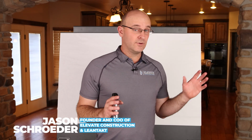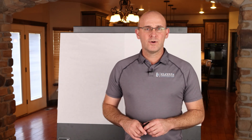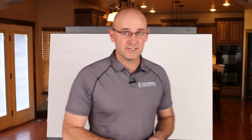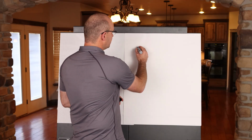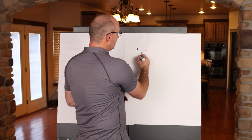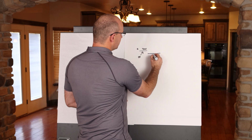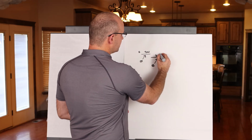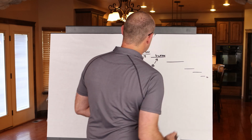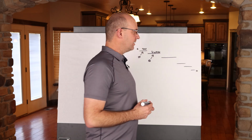So I'm going to take you through my process for estimating time for a project. One time I had a project executive sit me down when I was younger in my career and say, "Hey Jason, this is how you do it. You take your milestone and then you basically just draw a line, and if that's your mobilization, you estimate that. Let's say that takes 3 weeks. Then here's your basement over here. That's probably going to take about 6 weeks." And he just kept drawing this throughout, like an executive summary on a schedule, and said this is how we target the end date on the project.